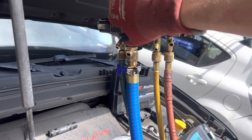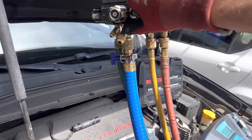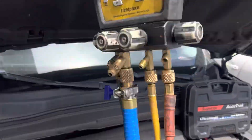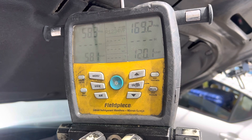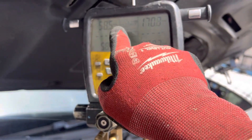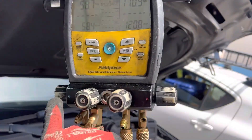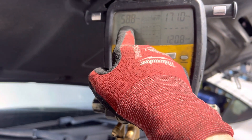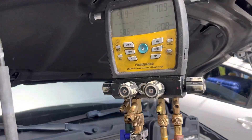There we go. You're watching the pressure go up with me now. On the high side, with the cutoff expansion valve, I pushed in 170 PSI right here, but as you see on the other side — the low side — it's off. There's not 170 PSI over there because the hard shutoff expansion valve is not allowing it to get over there.